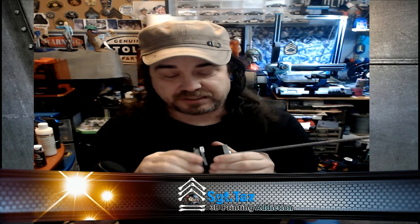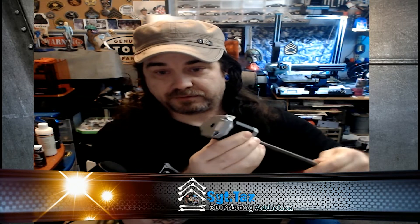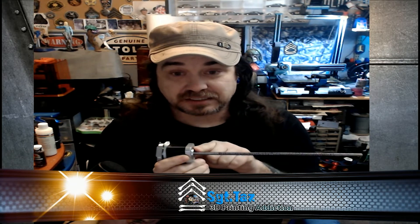They did send me a new one. In the next clip, I'm going to show you how to replace this whole piece pretty easily. Also, a little ounce of prevention to prevent any resin from seeping down, which I thought was the initial problem — it wasn't. It's the bottom bearing. It isn't the resin getting in by accident; it's just a bad bearing. It just didn't want to turn. You can hear it grinding. So it may not be the lubrication on your Z — it might actually be your stepper motor bearing on the very bottom or the top one locked up, gripping and seizing up your motor. The next section will be replacement — I'll show you how I did that.